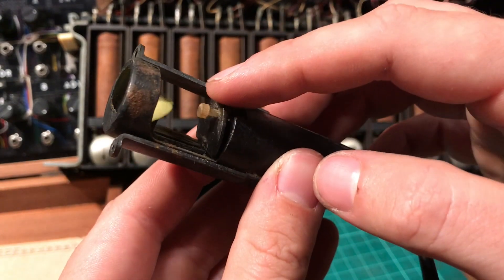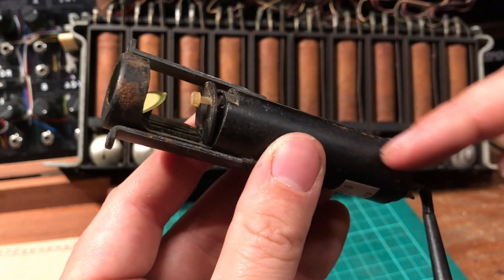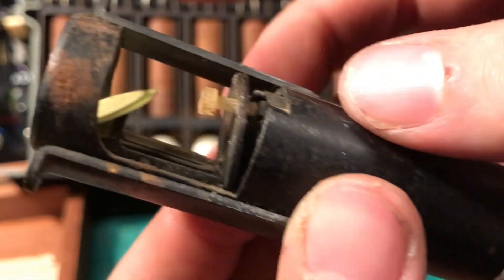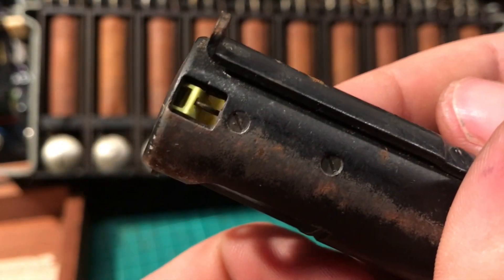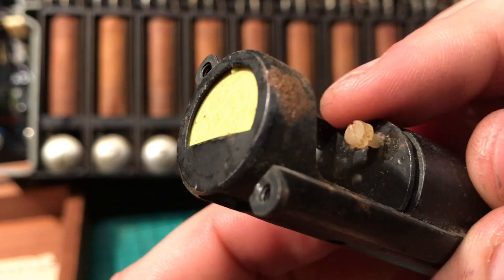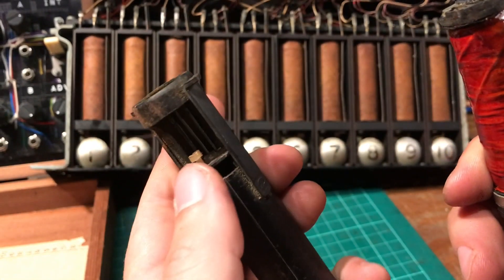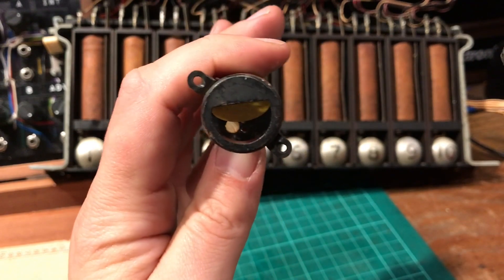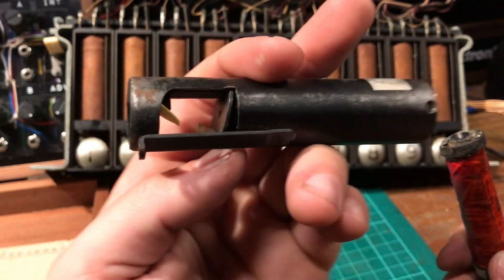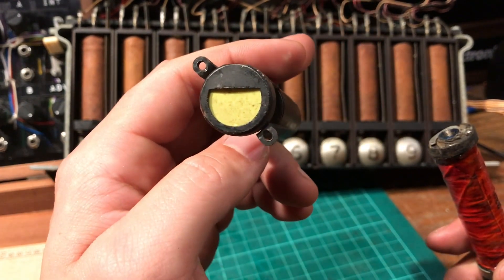Let's have a closer look at the mechanism. You've got this armature here, which is the actual metal plate that gets attracted to the magnetic coil - that's all the way back in this part. So that levers this way, and you see down at the bottom of the plate it's connected to a little metal rod that goes along here and is actually hooked into the bottom of the plastic flap. So when the armature moves, it moves the rod and that levers up the indicator. If I pull out this coil, on the end of it there is a spring. That is what returns the armature to its outwards position, where the indicator is tucked up inside. So when there's no power, the spring pushes the armature out and puts the flap up. When the magnetic force turns on, it overcomes the spring, pulls the armature down and actuates the indicator.